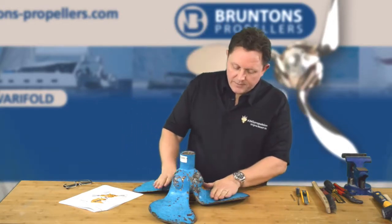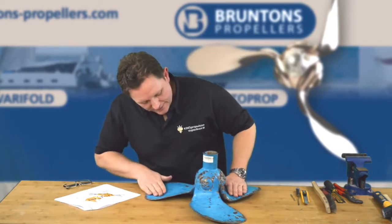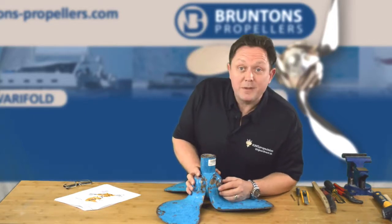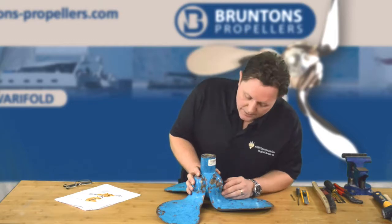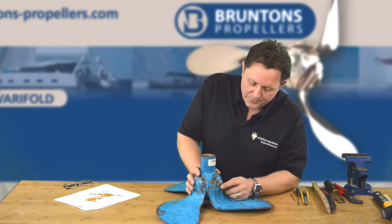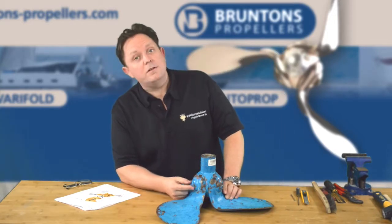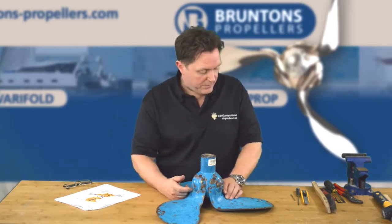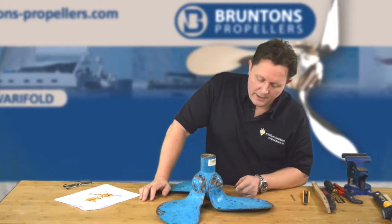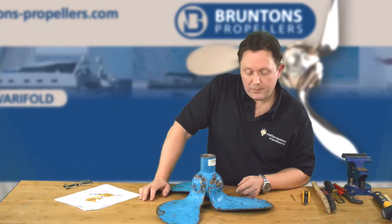What we need to do is start to peel back some of the ablative bottom paint that's been plastered on. Now I know from looking at it, you can see the grease ports here — this one in particular has not had any grease because it's been painted over solid. So the first thing we need to do is to free up all the grease ports. I tend to leave them in before I strip it down so that no gunk and goo gets in there as much as possible. These are M5 metric and I need a three millimeter metric Allen key to get them out.